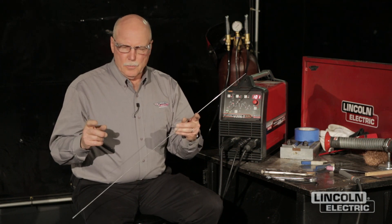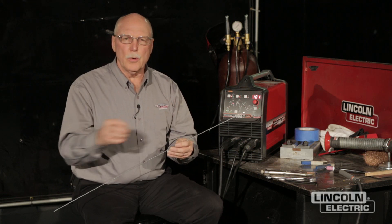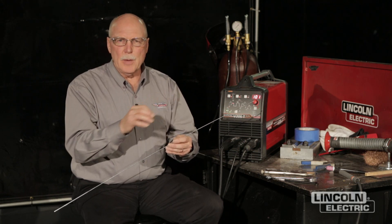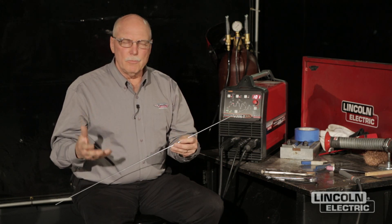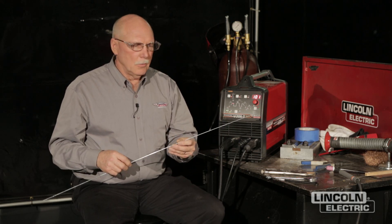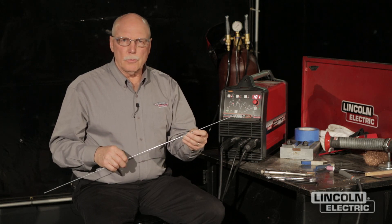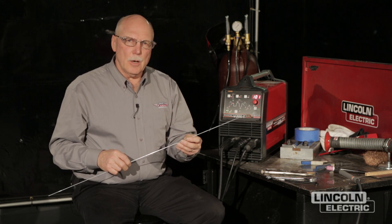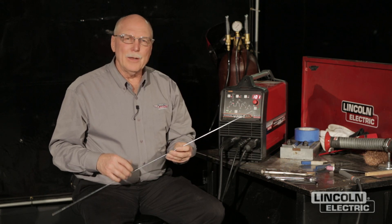Traditionally it's been stick rod — a shielded metal arc welding electrode — and it's been coated. It's a 312 stainless wire, but it's generally in mystique. It's got either a bright colored coating or some special name on it, and they won't tell you it's 312 stainless wire. But it's a special maintenance wire for welding files or welding things that you have a hard time welding without cracking. In TIG welding we use it in its bare form and just call it 312 stainless. And 312 stainless does a great job on high-alloyed, high-carbon, strong materials and resisting cracking.